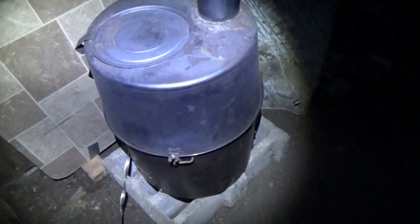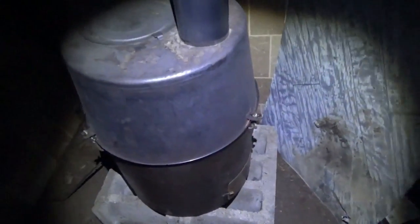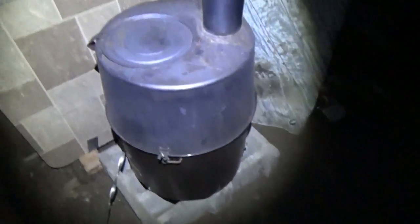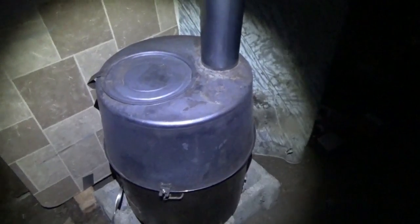I'm going to experiment. I definitely have to put rope gasket — fiberglass rope — all the way around inside and put it back together, because it's leaky and getting air through there. I'm going to have to put a seal around the back panel too. You can see the glow of the fire leaking through — it leaks badly. That definitely needs gasket. There's a glow behind the door down below as well — that's leaking too. Maybe I can seal it up and get it under control, maybe not. It's worth experimenting now that I have a hole through the roof. In the worst case, I could always swap it out with a bigger, more controllable stove and larger stove pipe.